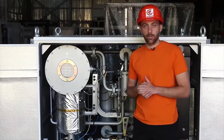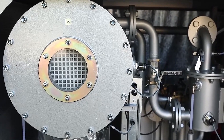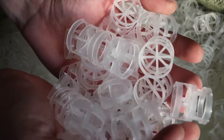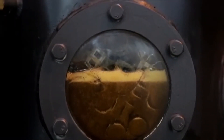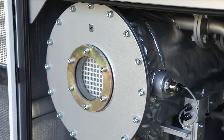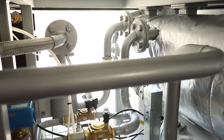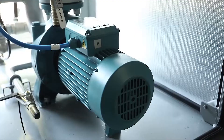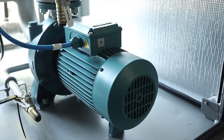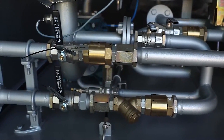The dimensions of the vacuum chamber have been reduced. To maintain high efficiency of oil drying, the chamber is filled with special circular inserts. The size of each individual element is small, but due to the design of the ring, the oil spreads over its surface and forms a thin film, thus increasing the exposed contact area. Under the influence of vacuum, water intensively evaporates from the oil and is collected in condensate containers.